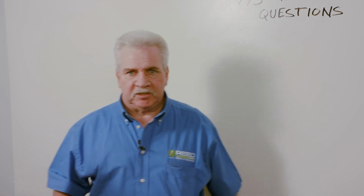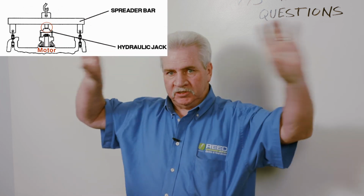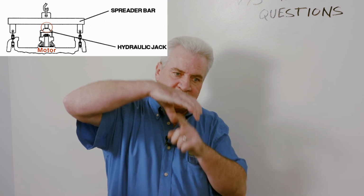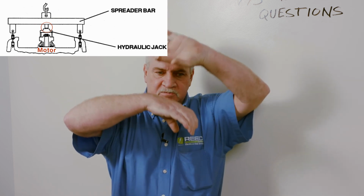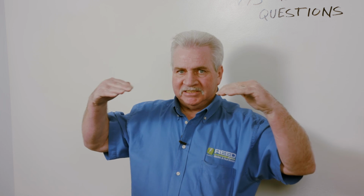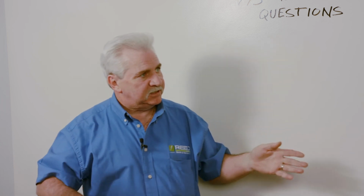Okay, I understand. Again, I'm going to just recommend to you guys kind of watch it. Every time that we've had any discrepancies on endplay settings, again, our chains are coming down around to the ears, our bar is going across the top. We have what looks like my hand as a fixture with our jack assembly on top of it between the pipe or the I-beam where we're jacking up. We can actually see the bracket trying to flex, and it can flex 5 or 10 thousandths real easy. Very easy. So what was happening is we were sending some of our verticals out with the lower bearing up against the cap preloaded